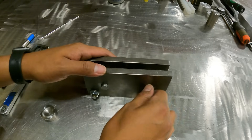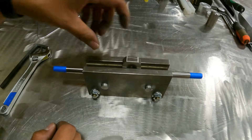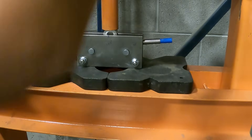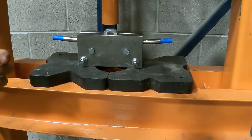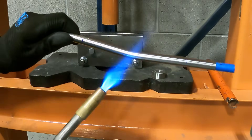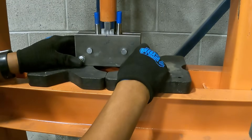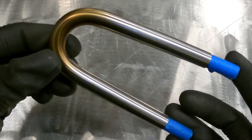This is what it looks like when it's all bolted together. The wheels still spin freely and the puck goes on top with the hydraulic press pressing down in the middle. The forming of the shackle went pretty smoothly — I thought the material would resist a lot more, but the hydraulic press made pretty short work of it. I used a torch to heat the shackle a little bit to prevent any cracking on the outside radius of the bend, and it worked great — there was no cracking or any surface imperfections. After it came out of the press there's a really nice even bend on that shackle.